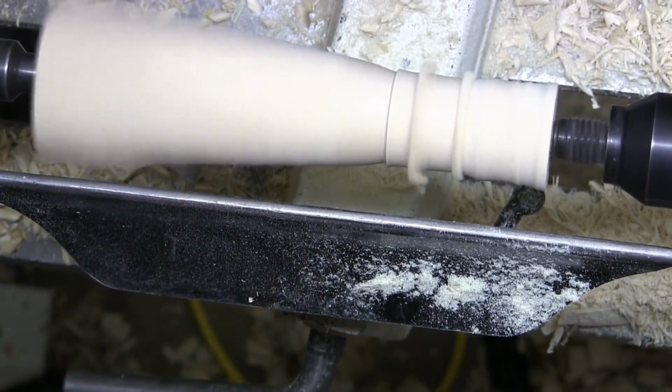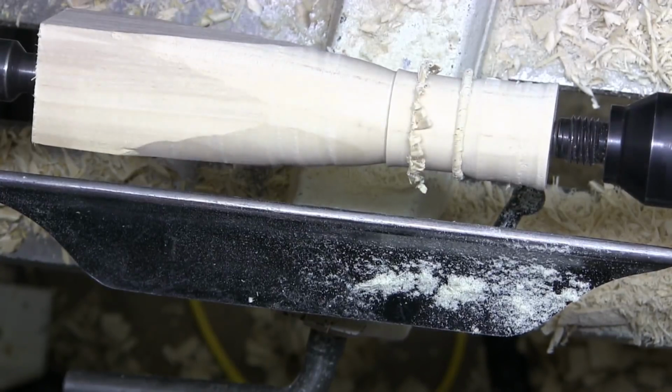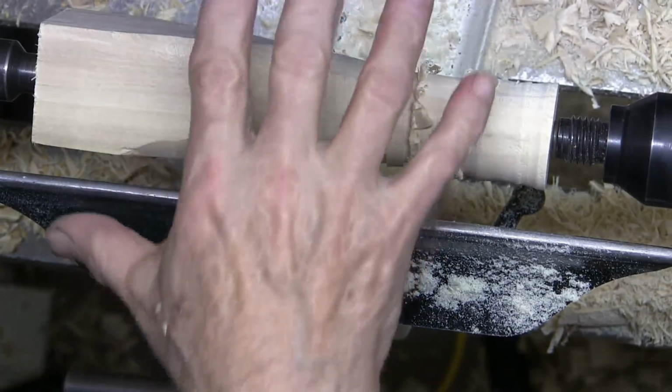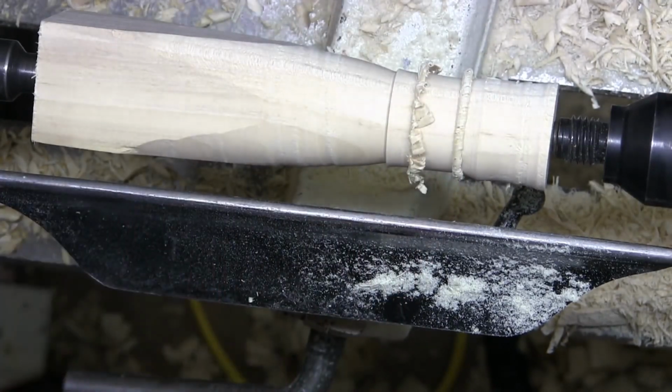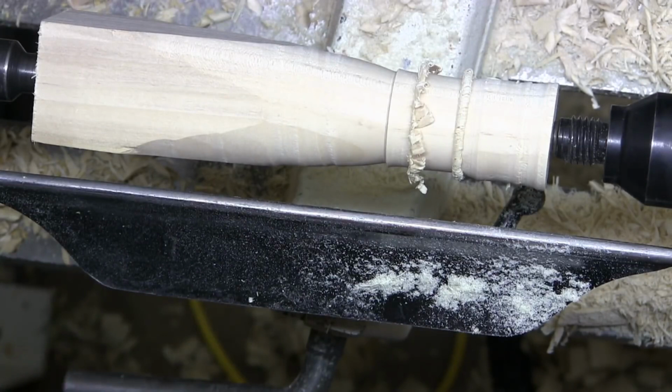How much support do I have on the tool? How much is very little? Not enough? Maybe an eighth if I really push the envelope, but as soon as it crosses, ooh, do you see how diameter figures in now? What if I have a 10-inch bowl and I'm going to take my skew and plane? Just the tangent of hitting the bevel, raising the handle to engage, may push it right into a dig-in immediately with violence in a bowl.